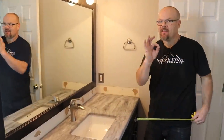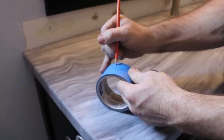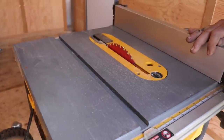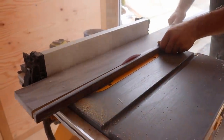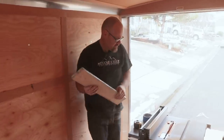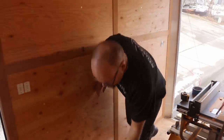I like the return going into the back wall as opposed to side splash first, then back piece — it's just a cleaner overall look. Another pro tip: to remember your measurements, write them down or use your cell phone and take a picture. You can write your measurements on a roll of tape and peel it off to have a fresh note card anytime. Measure twice, cut once. I like to cut inside my trailer whenever possible — it avoids tarps and canvases, especially in winter here in Oregon. When we pour the backsplash we do it oversized, then trim it to size on site for a factory edge with no epoxy on the bottom.